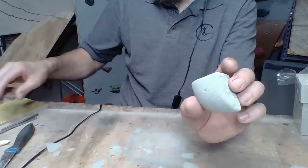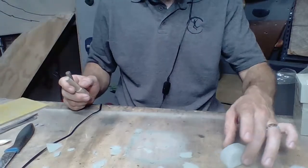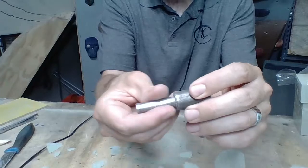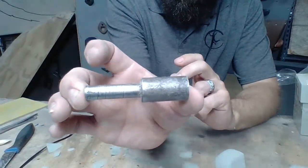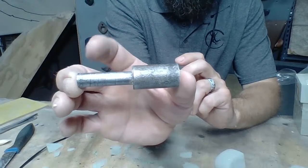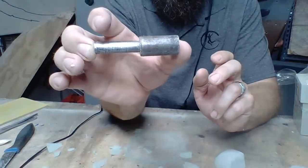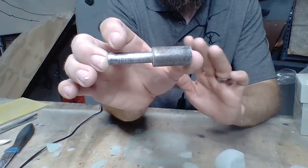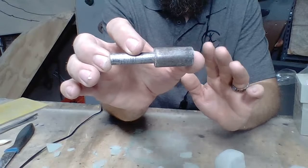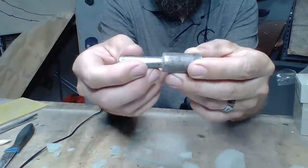Now there's a couple of ways that you can do your bolt holes. One way, and this is the way I was doing it when I wanted to do this for a business, and in fact, this is one of my first dowels that I made. So this up here is at a 7/16 inch, and this is 3/4 inch. With this being 7/16, you're going to have a little bit of play in the bolt so it doesn't get jammed, and the backs of your holds don't have to be absolutely perfect. It can rock a little bit on the wall and level itself out. It's a 1/16 of an inch, which really means that you have a 32nd of an inch on both sides of the bolt. Works perfect, 7/16 in the States.